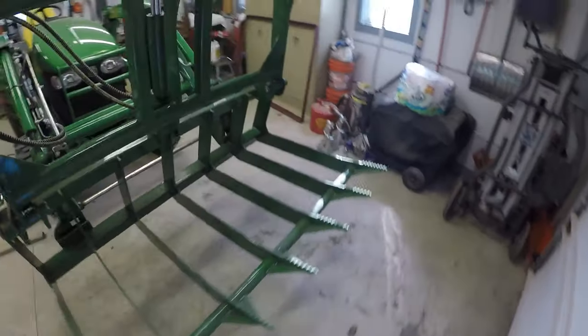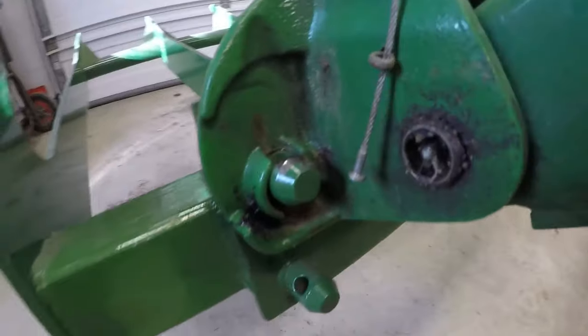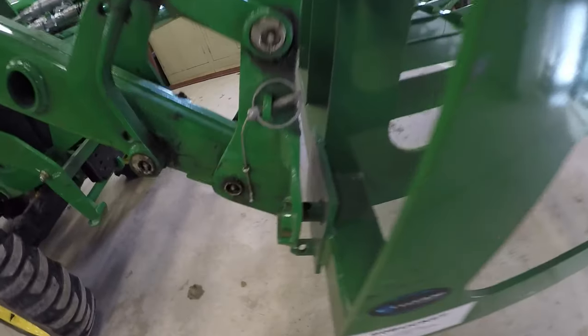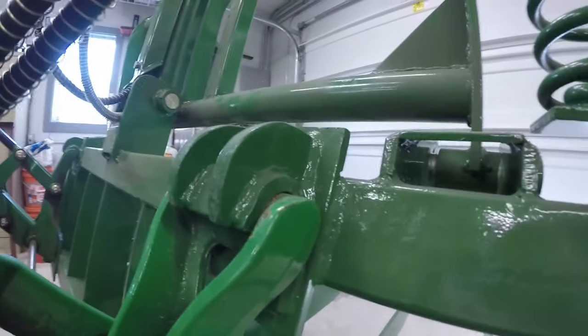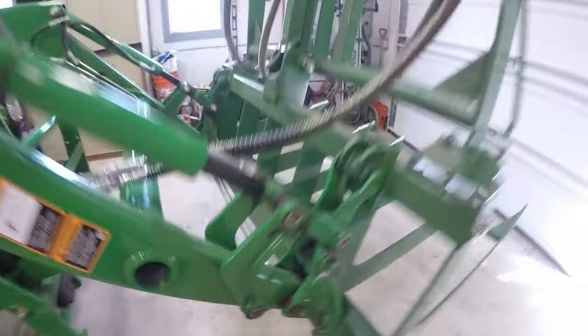I am having one issue with the fit on this side. It had a little trouble getting in there but after it wore the paint off and scraped down it did fit — tight at the top. But there's about an eighth inch gap underneath and it's actually rubbing the pin on top. Unfortunately on the other side it won't even fit; it's hitting the pin. I could grind that pin down a little, but first I'm going to clean the paint off the top edge and file it smooth. Hopefully I won't have to grind the pin. I bounced it around on the loader and it just happened to slide on with enough clearance to get the pin in. Then I drilled and tapped two holes, moved the hose bracket, and bent it back at a slight angle. It seems to work pretty well now.